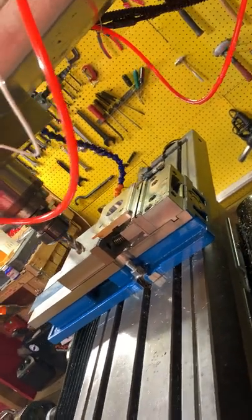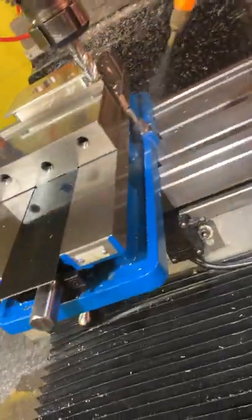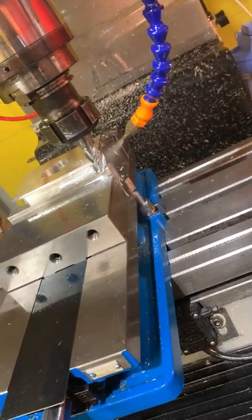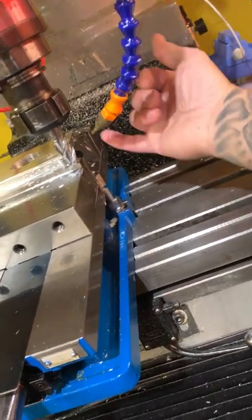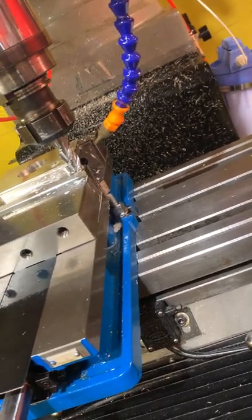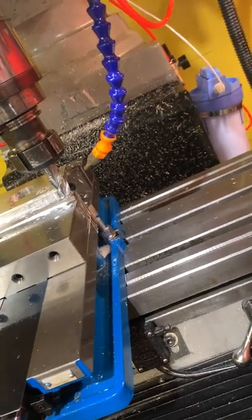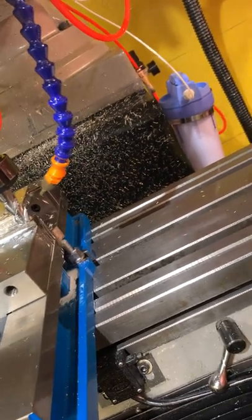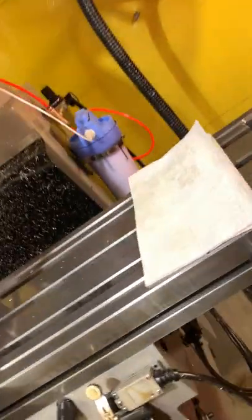Okay, we're gonna start at 20. There's a little bit of coolant coming out actually, but maybe I didn't have that closed all the way. Okay, so that's closed off, where it's just air. Now this is 20 PSI. Oh yeah, that's way stronger than before, probably because I got that new hosing line on there. It's not all gunked up with old nasty coolant.